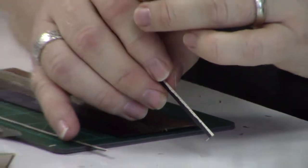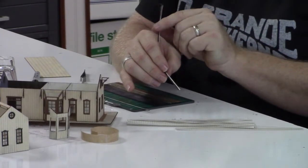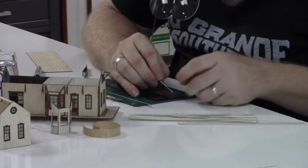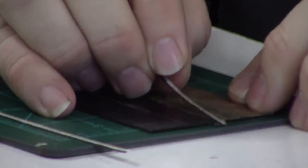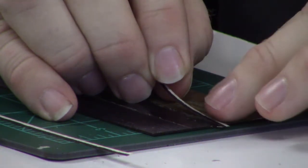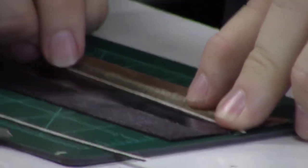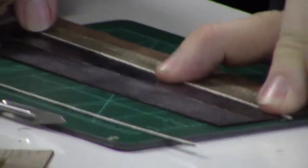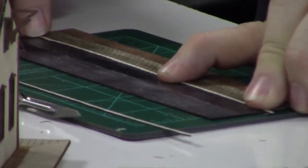Can you zoom out just a bit? There we go. So if you can see, like here, I've got the extra part of the row up here between my finger, and I've got my finger and my thumb, and I've got it resting here. I'm going to come in, I'm going to make sure that my tabs are offset, that I'm coming down just to the top of the row in front of it, which if you're putting your bottom row on, you don't have to worry about it. You can just put it on however you want to. And then I press it into place on this end, and then I come down a little bit further, pull it tight, I'll come in the middle and I'll press it down a little bit. I'll come a little bit over further, checking my alignment all the way, press it down again, and then come out here to the edge.